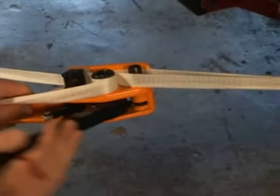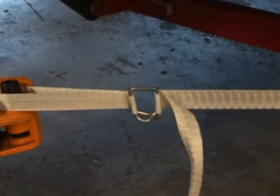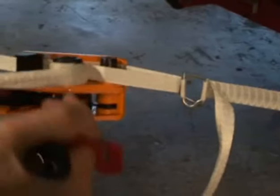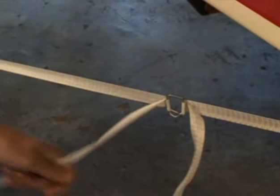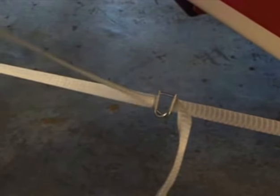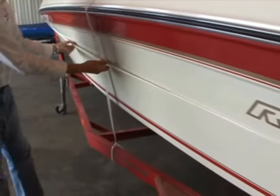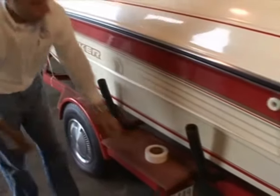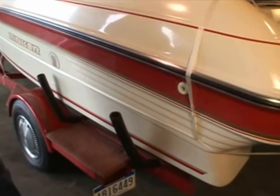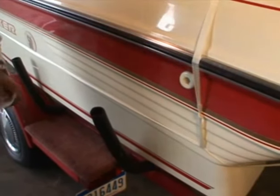The strapping itself is a woven polyester cord and it will stretch only about one or two percent just before it gets to its maximum break strength. Ryan will go down and feel on the side of the boat to make sure it is tight enough before he cuts the strapping off. Ryan is now checking the tension in the side of the perimeter band — again we want this extremely tight. He will also cover the fuel vent at this time. It is very important that the fuel vent be covered so no fumes are escaping. A simple piece of tape over the fuel vent will make that happen.